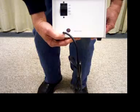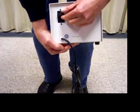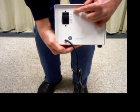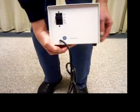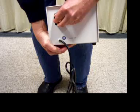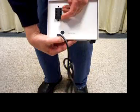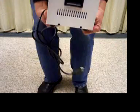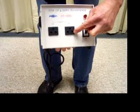You make the choice of the input on the back. You have a 110 input, which you would use in the USA. 220, 200, or 240 would be used in countries that have that voltage. When you set the voltage, this plug — in this case it's moved down to the 110 input — plugs into a 110 outlet, and you have 220 volts coming out of the front.